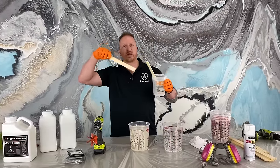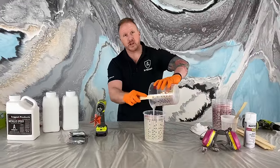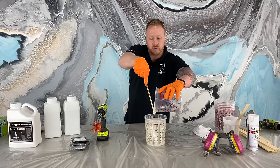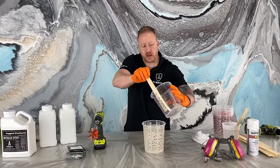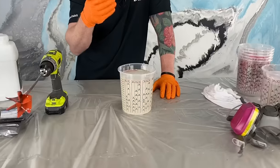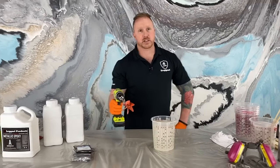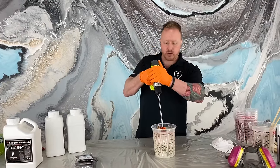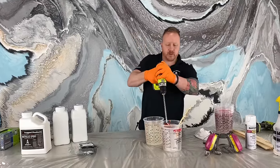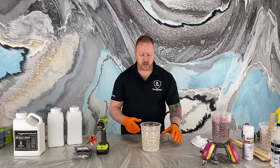Be careful with some containers that are really flimsy — you can actually break the container. Now grab a fresh paint stick. Don't use the one we used to mix part B into part A. Pour all of this material into a new jug and mix for another 30 to 45 seconds — you can't guarantee you won't have soft spots if you skip this step. Soft spots are a nightmare in the industry. I can actually see some part A on the edge of the container now in the middle of the resin. Mix another 30 to 45 seconds in the new container and it's ready.